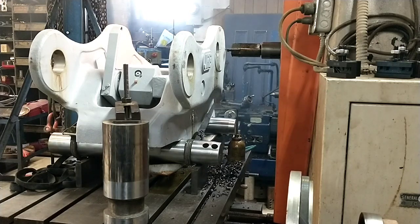But we got chewed through there. Didn't really like it. I'm going to have to double check. I don't know if you guys could see it. It was shaking and rocking my whole fixture setup. What I think I'm going to do is get that hole punched out to the actual roughing size. I dropped the spade bit size. I'm going to bump back up, punch through there, and then double check.